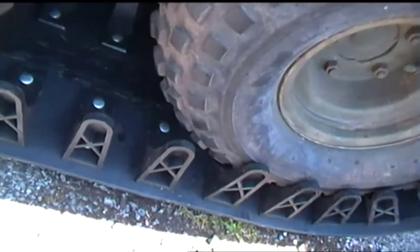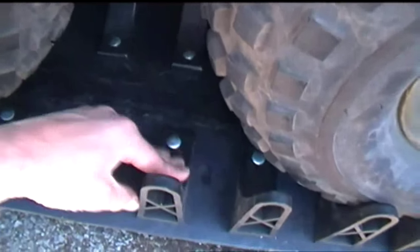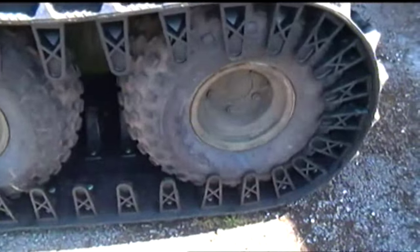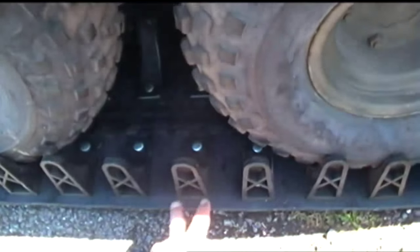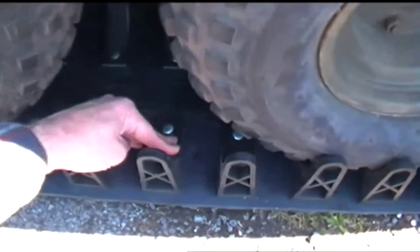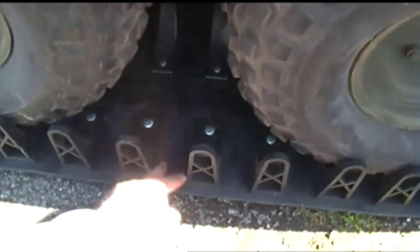Initially I thought, well, that'll be all right, they'll grip on the tracks, but it's all too smooth. The rubber area is just far too smooth, and they're just spinning. So I need a tread pattern that will grip into these tracks. Basically, you've got 2 inches here, and around 2 inches there in the actual, what would we call it, grip point, the tooth, the lug on the tracks. So I'm looking for something with a spacing like that, some sort of tire pattern which maybe will sweep across like so, in a V, and grip in between these track points.